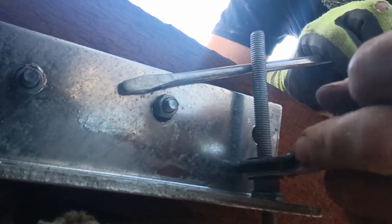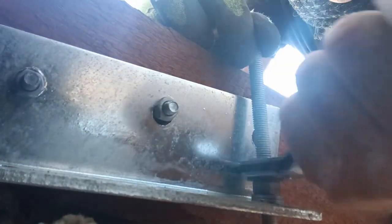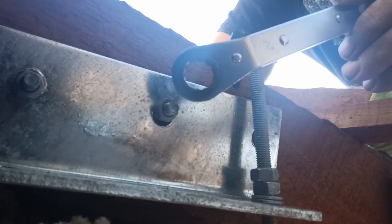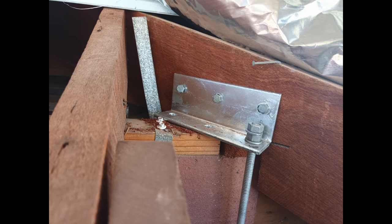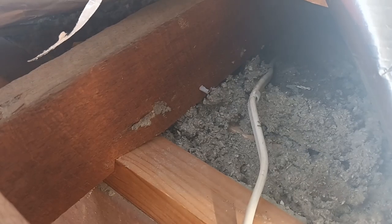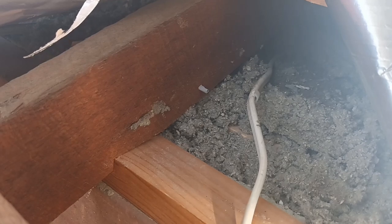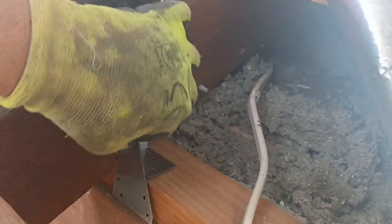The engineer specified that the plate I'm now tightening onto is 6mm, and so that's what we have. The rod is standard - you get it at the hardware store. The rebar through the wall is 12mm and these screws are M8. The engineer also specified that in between every single tie down, every other rafter has to have one of these called triple grips, just to hold it all together and tie it down to the roof.